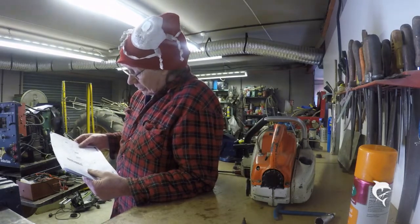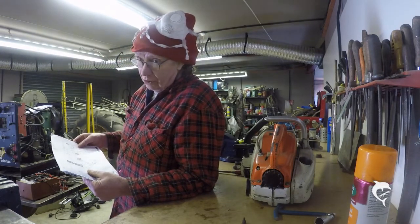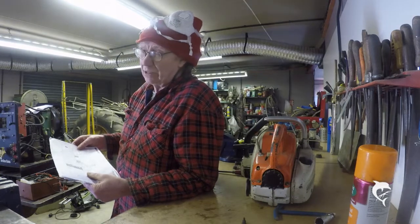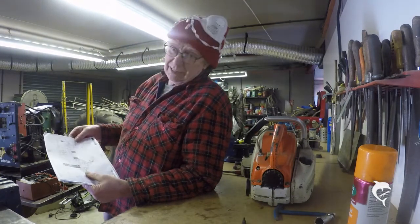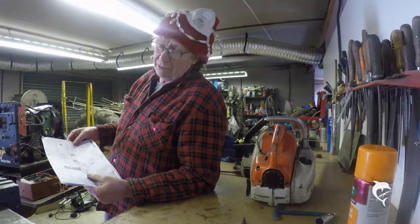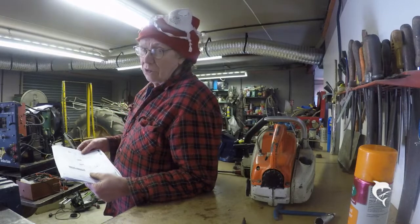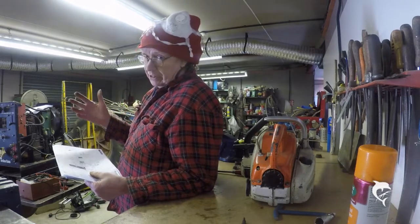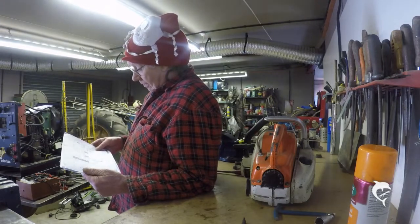I've checked the switch. The switch seems to be absolutely fine, but again, it had a dodgy loose spade tag on the back, but it was only loose, it wasn't off. And also, again, it's carrying a fairly high voltage, so you wouldn't expect a little bit of looseness to stop the whole circuit working, but it's a resonant circuit, so you never know. Basically, that's it for this week, chaps.